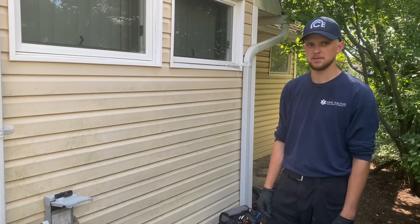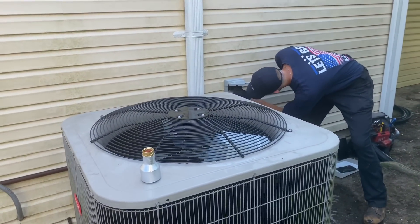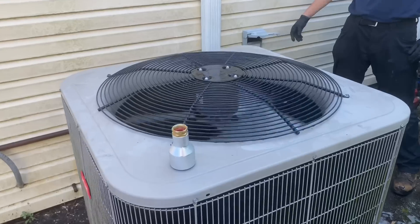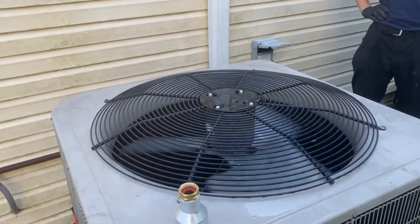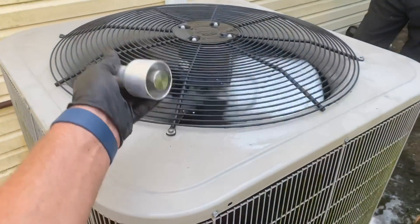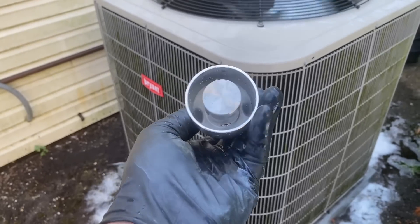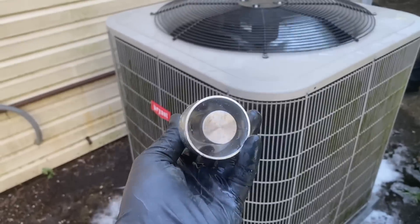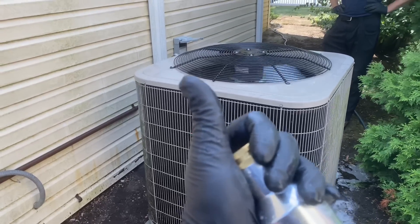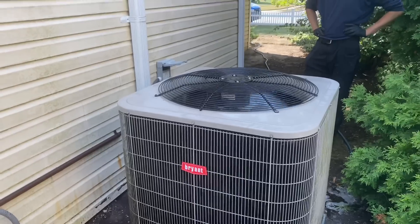Are you ready? You want to do the honors? You want to plug it in? In case it zaps, you know, unplugging quickly. Baruch Hashem! Look at that! Thank God! The condenser fan motor is operational, and so is the compressor. Shout out to Cool Presser - awesome tool. The Bryant is now up and running. We identified the problem, realized what could cause its failure, corrected the potential failure, cooled off the system, restored power, and we're operational. Let's go give the good news to the homeowner.